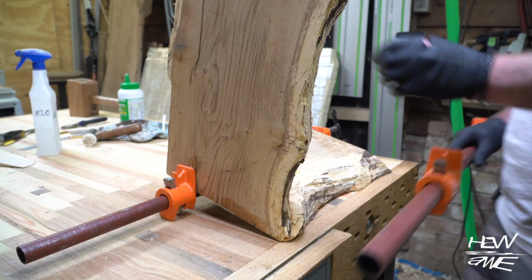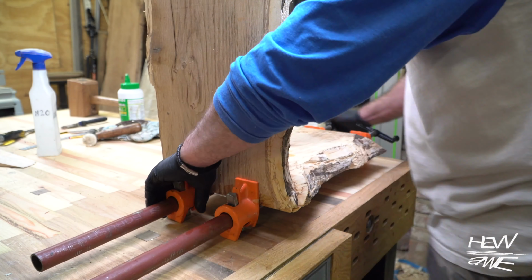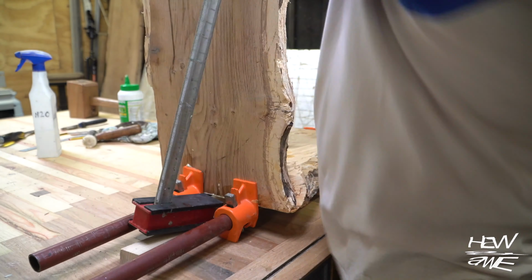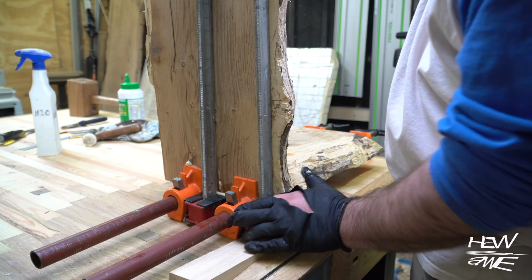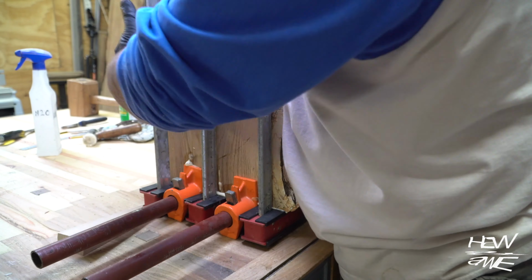It is expensive, I know, and a little does go a long way. It's messy, and I do find it actually quite easy to clean up. Just need a sharp chisel. Don't wait for it to go rock hard though. Wait for it to go sort of like a soft honeycomb type feeling, and then use your sharp chisel on it, and it'll be absolutely fine.